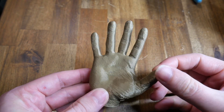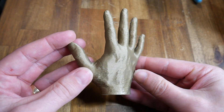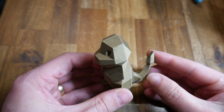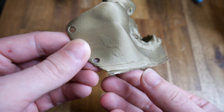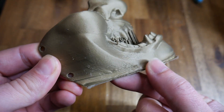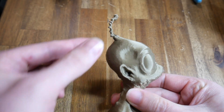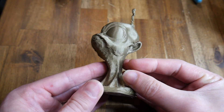So how are the test prints before post processing? I've noticed on all of them that there are little blobs on the underside and therefore really strong part cooling is of great importance for this filament. When the layers are stacked more or less vertically they come out quite clean, but when they're shallower, like on the head, they are much more prominent. I also noticed there's an area along the bottom of each print where the heat from the heated bed seems to melt or slightly deform the plastic during printing. Overall I'd say this filament is fairly easy to get good results with, but to get excellent results you're going to need to experiment with both hot end and bed temperature.